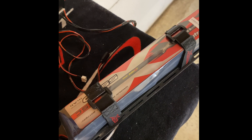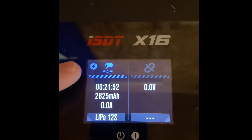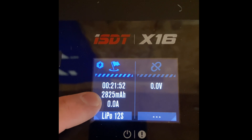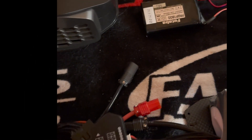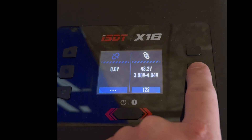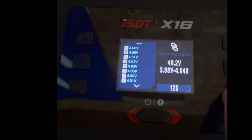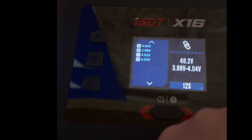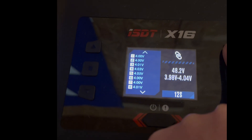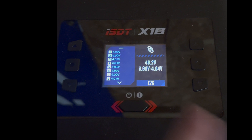This is the first charge on the battery I'm going to show breaking in. After I take it off the charger, you can see it came from the factory about half charged. I don't have the main leads connected yet — I just plugged in the balance port — and this is after the first break-in flight. You can see there is some voltage difference between the cells; they're a little bit all over the place, just a little bit different. I'm going to go ahead and charge this back up at 1C from this condition.